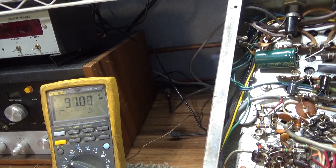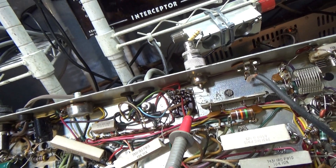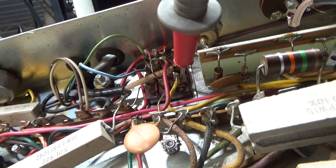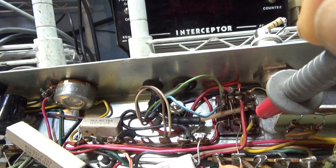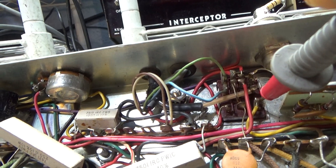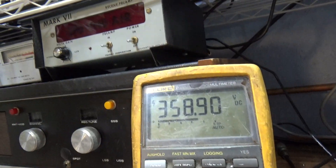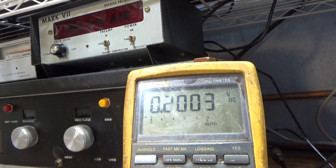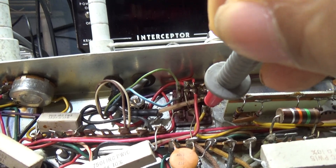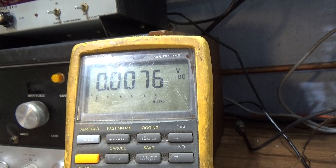That's the voltage going into the relay: 360 or so unkeyed, drops down to 90 when keyed. On the other side of the relay — the yellow line — be careful if you're doing this hot, that's 350–400 volts right next to the relay, almost directly connected to the high voltage besides the resistors. The other side reads 360 coming out on the ground side when unkeyed. When you key it up it should read zero, because it's putting the ground on that side.